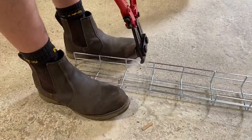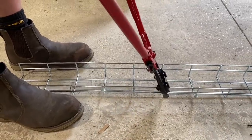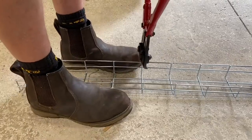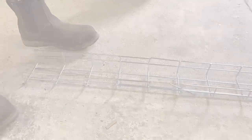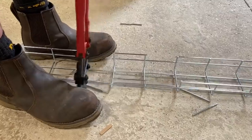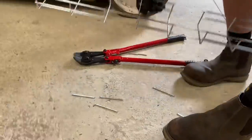We're going to start off with a bit of fabrication — that's what's brilliant about this steel wire cable tray from Atcor. I'm going to call it basket for the rest of the presentation; it's so easy to fabricate. We're going to make an external 90 degree bend first, and a bit later on we'll make a flat 90. It's just a case of removing the sections out of the side of the tray as appropriate before bending it. I have done another video on this — I'll leave it in the description — where I went through almost a one-to-one tutorial of how best to cut the cable basket.